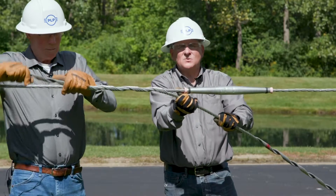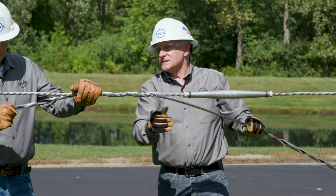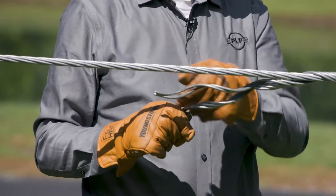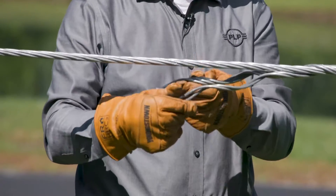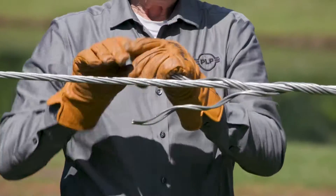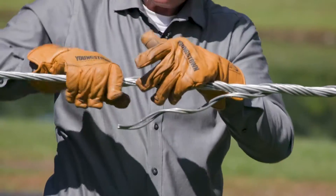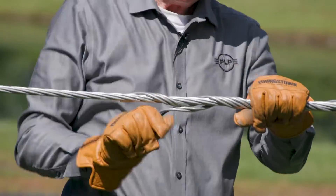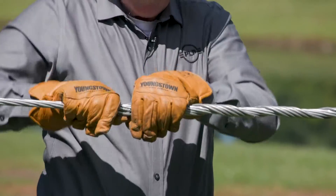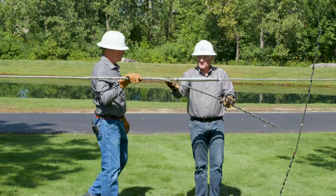When you get to a point two or three pitches from the end, you can go ahead and split the rod ends to simplify the application. You can split them into even subsets or even down to single rods if needed. Once you reduce the number of subsets, it will simplify the snapping of the rod ends of the splice shunt and ensure proper application.